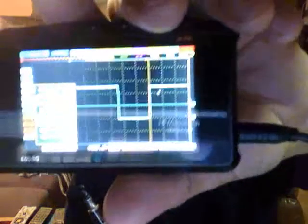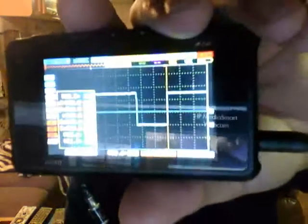Now, as you can see there, the volts didn't go up quite as high that time. It definitely dropped it down some, and it says it ran at peak to peak 6.8 volts, and then DC voltage is 4.16 volts.